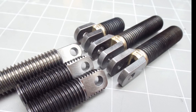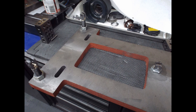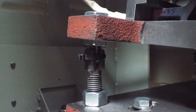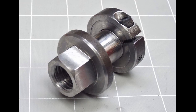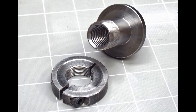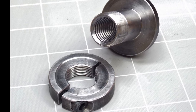I chopped up the existing studs into this configuration with some cold rolled ears silver-soldered onto the posts to provide the pivot action. Here are those pivoting studs mounted in the base plate that is bolted to the bottom of the machine. Here are the rear pivots with the wire ties holding the pivot pins in place, and the front pivot with the captive nut in place. Here's the captive nut I made up, and here you can see the clamp-style adjuster nut that allows me to maintain the correct gap on the plate for free slide and rotation.